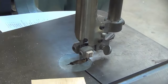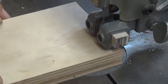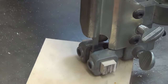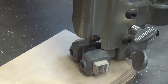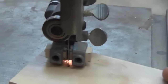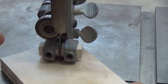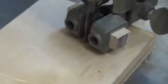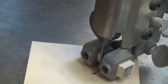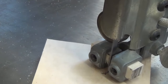This tool is capable of making curved cuts. If I try to curve too hard, you'll actually see some sparks and you'll see the blade start to come out of the machine — that's not good. If I try to back out of this situation, I'm going to start pulling the blade out again. This is a bad situation to be in.